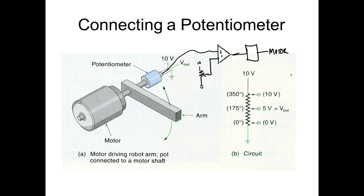It is, but people think that motors just run, but we can control them. A perfect example is we can limit the stroke on something that has no limit, but we do it electronically, right? Or electrically. So that's what they do on your car door. If you ever took that thing apart, you'd see a motor on there, and they limit the stroke on the motor. It allows us to create a lot of torque in one direction and then turn it off, right? Electric motors don't like to be stalled. They'll burn up.